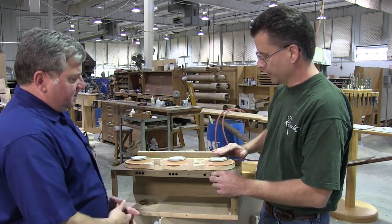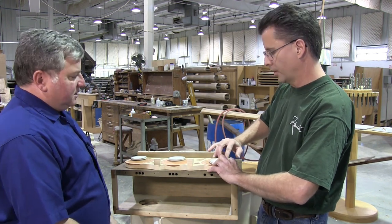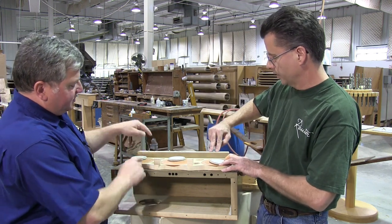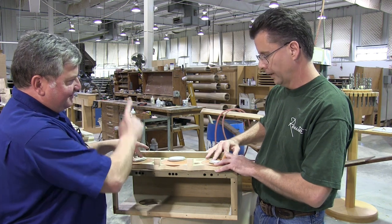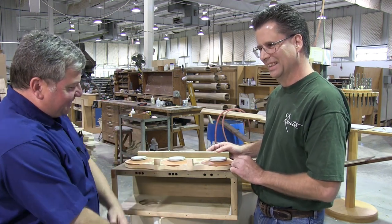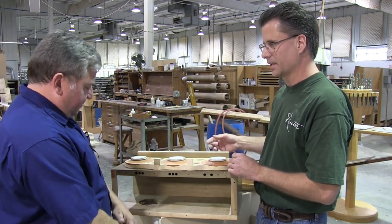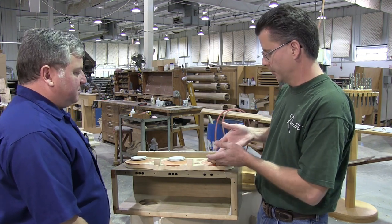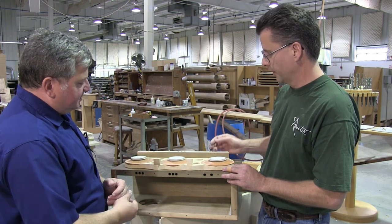These channels. And so then the wind pressure pushes on the leather because it's now a greater pressure inside the chest. These channels connect here. Yes, the channels on the pouch board. We have atmospheric pressure, organ pressure pushes down. It seems simple when I put it that way, even though there's a lot of complicated parts to get it there. Right. And so then when you release the key, it reverses and the valve changes position and lets chest pressure come back in. The pressure equalizes and the spring pushes. There's a spring under there, actually. Yeah, the spring pushes the pouch back up.